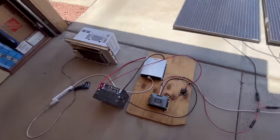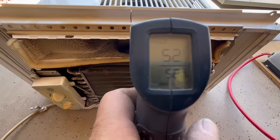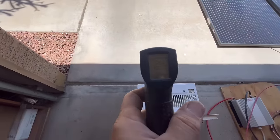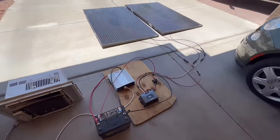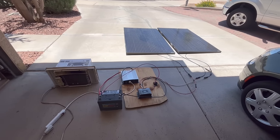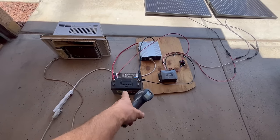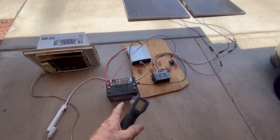So pretty easy to do. This has actually been running for a few minutes and if we look, we have 43 degree air coming out. It's about 95 degrees outside and that cement temperature is 124 right now — a little warm to be walking barefoot. That is how you connect solar panels to run a 5,000 BTU air conditioner. You can do this for a room in your house, but I wouldn't put the battery in there — marine batteries will let off gas while they're charging, so you can't have that in an enclosed space. It'll end up causing a lot of problems if not a fire, and those fumes are not good for you to breathe.